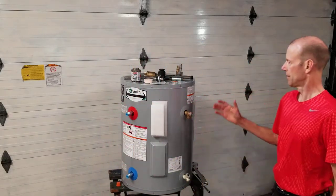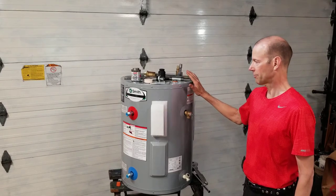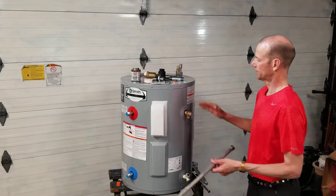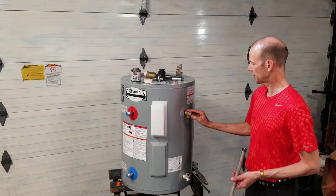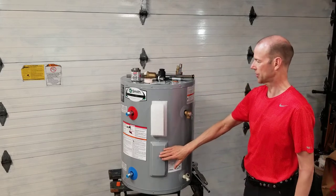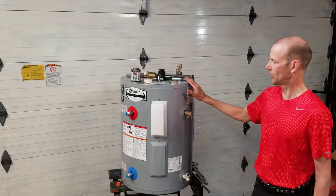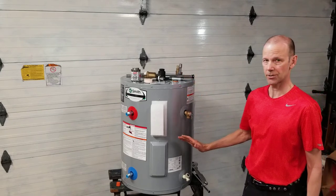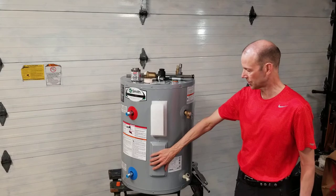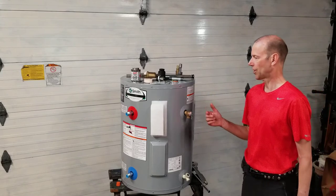Bruce with Natural Heat. This video about converting a hot water heater to a hydronic buffer tank will cover three main points: dealing with the anode rod, replacing the four water fittings, and looking at the fitting for the electric resistance coil. Why convert a hot water heater to a buffer tank? It's about a third of the cost, available at your big box store — this one from Lowe's — and it has an electric resistance coil that allows it to run as a backup heater, serving two functions for about $700.